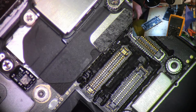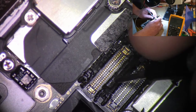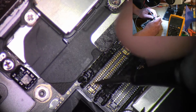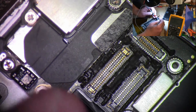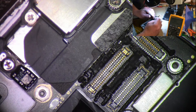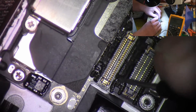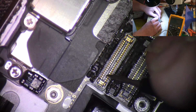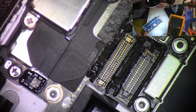The next thing I started doing is checking all of the pins on the FPC connector to see if I had any odd pins that were grounded. The first one checked good and the second one checked bad. The second one goes to PP5.7, which goes to chestnut, and it should not be grounded. So from there I started checking the filter on it and the filter is grounded.